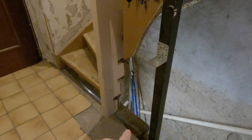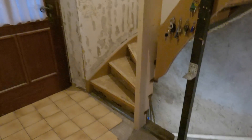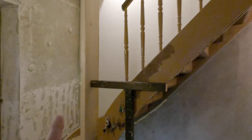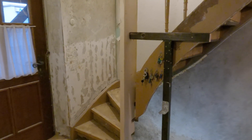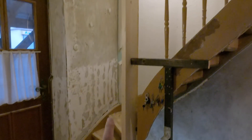It's the next day. Yesterday, I put the support beam in underneath and went and bought the lumber for the new wall that will go here. Right now, I've removed the post and braced up the stairs, and I'm cutting the new post. This is actually part of the main post that will support the stairs.